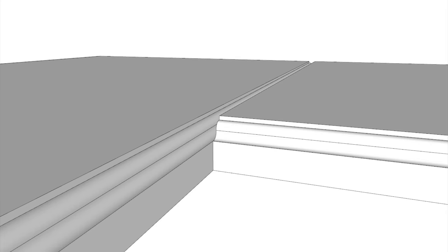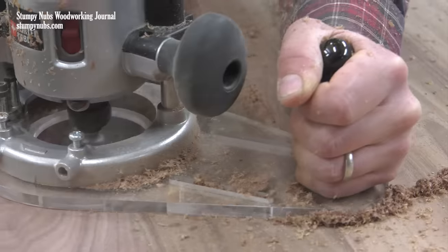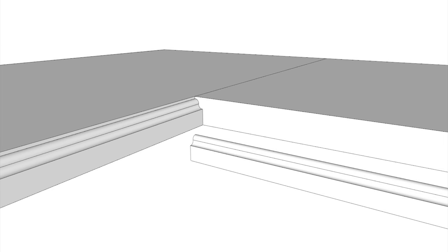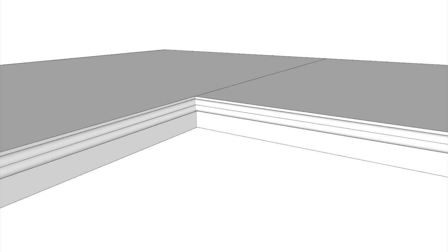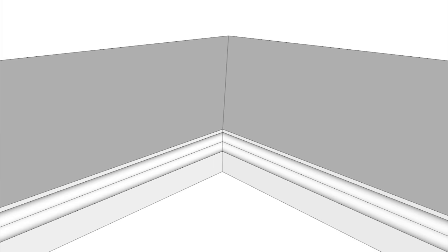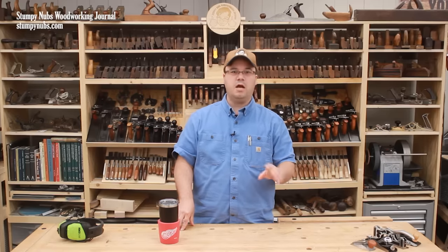If you try to butt two profiled pieces together you'll have a gap at the inner corner of the profile. This problem may be solved by routing the profile after you butt your slabs together, but since a round router bit cannot cut fully into a square corner you either have to settle for a radius in that edge profile or you'll have to hand carve the transition to a point. Another solution may be to add separate moldings after the main slabs are joined, coping the inside corners as you might baseboards or crown moldings. But if you choose to connect two panels with a large miter you may route the profile first and then you'll get a crisp corner just like a giant picture frame automatically. This is one factor to consider when choosing between a miter or a butt joint.